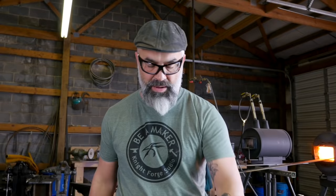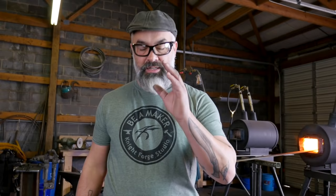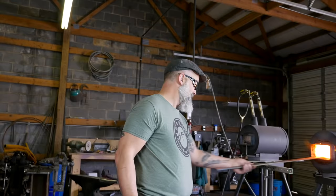I don't use the horn for that technique because the horn is unsupported. In my experience in bladesmithing, it's great for bending stuff, maybe doing some radius. I have another anvil where I do some forging in between where the horn and the body meet, but I use the edge for doing some extreme moving of steel — some massive metal mashing mayhem. We have an inch and a half by quarter inch thick 80CRV2, and that's what we'll be using to make this blade.